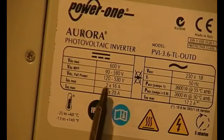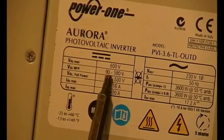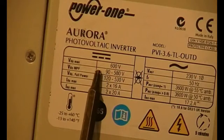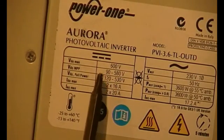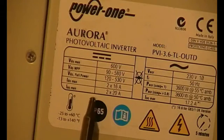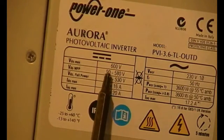The outputs are 230V, 50 Hz. So effectively this would start running with four 250-watt panels at a nominal 30 volts. On the system I'm building at the moment it's got five panels on it — so it's got quite a wide range and it starts reasonably low, which is very handy.